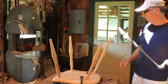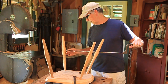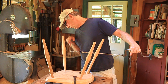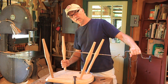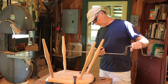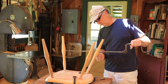I'm going to use this auger bit extension and put it up against the side of the leg right here. Look over the top of the bit and make sure it's hitting flat and square to where the nickers are going to hit at the same time. You can rotate your leg a little bit to make that work and it'll all come out fine. Back here for the height, all I have to do is hold it at this level right here where the point of the mortise is going to be, and I just transfer that point around to the side right there — so I've got a mark over here on the side.